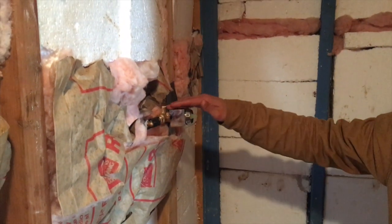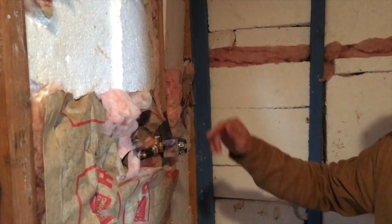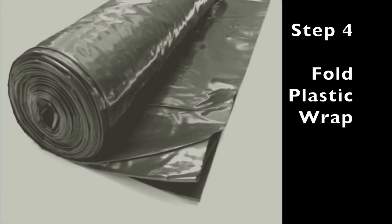Step three: make sure all your plumbing and pipes are inserted through the walls before you cover up the shower. An important thing to keep in mind — make sure your handle, nozzle, and spout are protruding far enough. If they don't stick out enough they'll be hidden behind the boards. We had to make sure our handle stuck out at least an inch and a half, because these are thick boards.